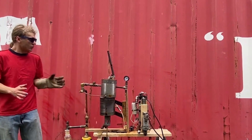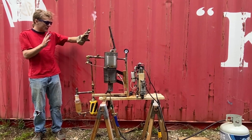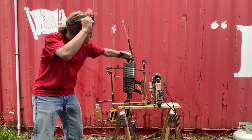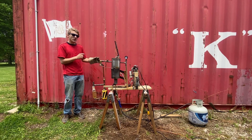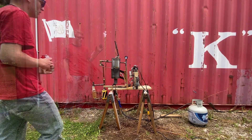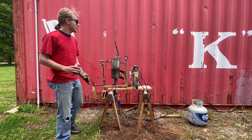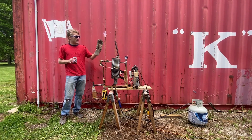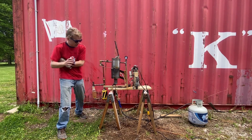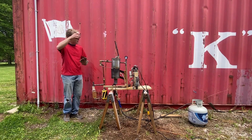I've never had water come out of the nozzle before because it usually just boils off, but for some reason it's boiling all the way up — I don't understand why. I have a feeling the superheater is actually full of water on accident, and that's causing the extra water to come up. I've been running it a few minutes with lower heat and not getting more steam, so I'm probably going to rebuild the entire system anyway since it's really janky. Let's close this off, increase the heat, and see what happens.